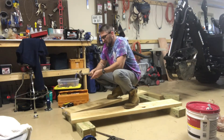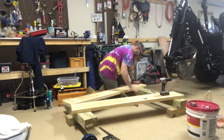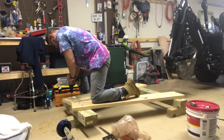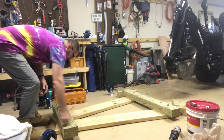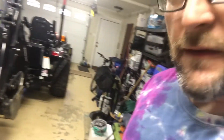Now that I have this laid out how I want it, I'm going to use some good old-fashioned nails to hold this in place. We got the carriage bolts in — all eight of them, all the way around, and tightened down. Used a 9/16 wrench to get those nuts tightened up. Now it's going to be time to put the 3/8-inch by 2.5-inch galvanized lags — 16 of them, four for each wheel — and get those wheels attached.